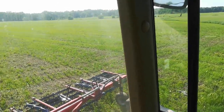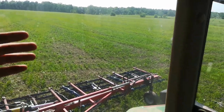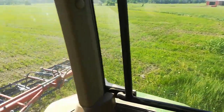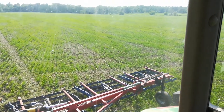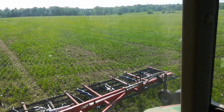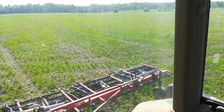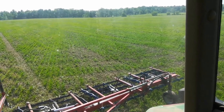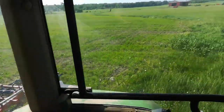I might have to swap this. This field is long enough that I can drag the residue over — there's a grass waterway and I can drop the accumulated residue in there. There were a couple times I had to stop out in the middle of the field because my gangs of tines were so full. I'll just have to drag that to the edge of the field using the tines at some point, or leave it there and combine around it.